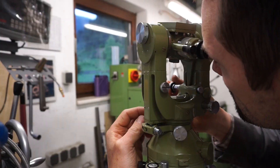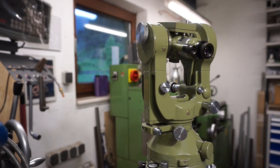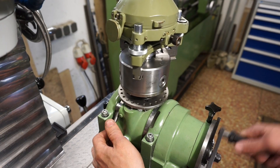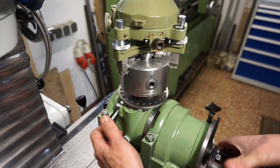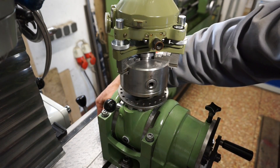A little fog came up, but that's no drama. Imagine carrying the surveying equipment a few thousand meters in elevation to the summit, where the stone markers usually are, and then fog came up. My father can tell you stories about this line of work in the Alps, which he did in the 1970s — adventurous stories. After resetting the focus a little bit, we read the inverted angle and note it. Then, of course, we set the dividing head to the next index, read standard and inverted angles, and so on.